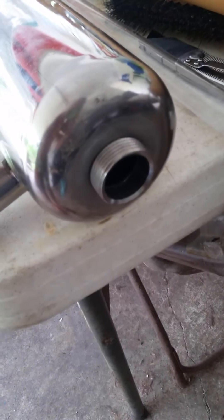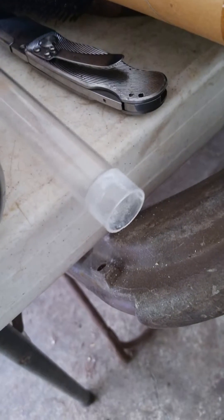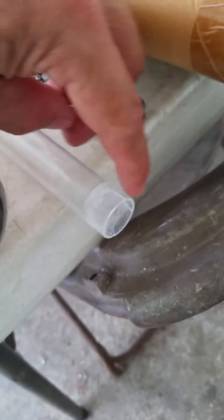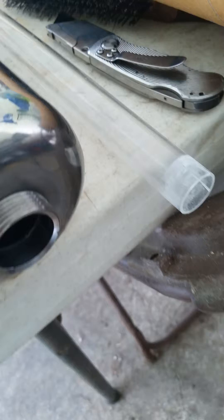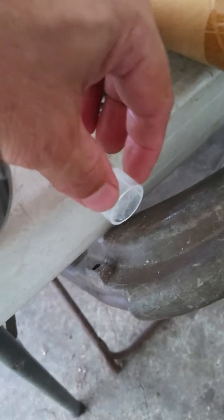It started to leak water inside, and the water popped my brand new bulb that was only about 100 days old. What appears to happen is on this top part here where the bulb slides in, you get corrosion and water damage. That throws off this O-ring, and as the quartz tube slides up, your UV bulb won't go all the way down. You'll keep trying to push it down to get your clip to sit, and you end up cracking the crystal — and this thing costs $40.